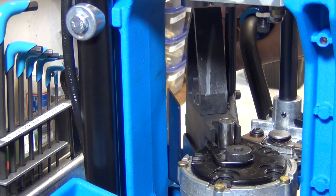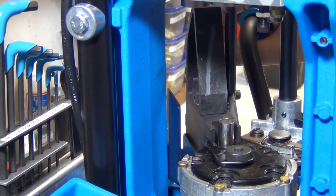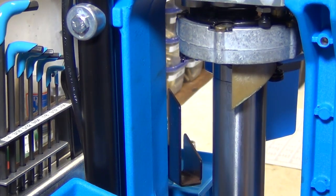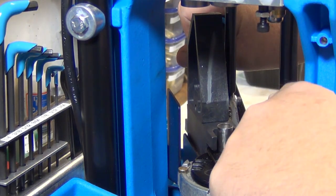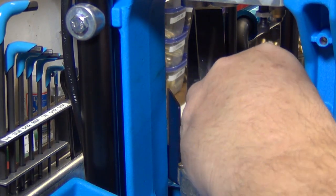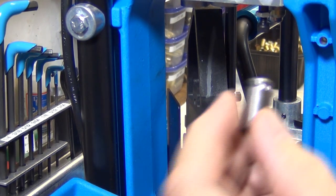Okay, on our second pull, we're going to resize this empty cartridge. We're going to rotate this out and put a new one in, and then we're going to prime this cartridge in this station right here. So as we come up, we're going to resize that one. See it rotate, and as I come out, we're going to both seat and place the cartridge right in there. So as you can see, we have a resized primed case now